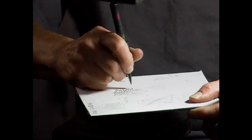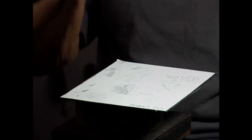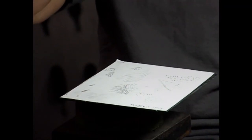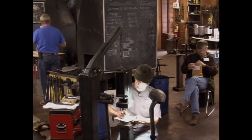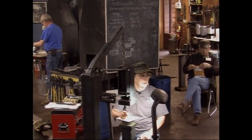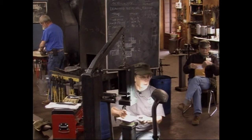When you have a treadle hammer, you're putting your hand under it. Make sure you have some safety device. Don't think that a piece of wood under the treadle is going to work, because there's enough vibration, it'll move out from under there.